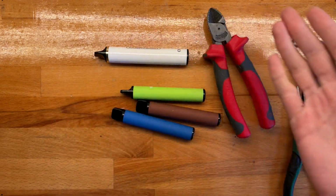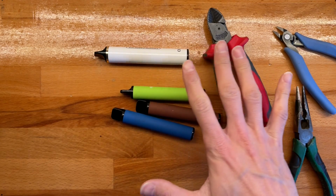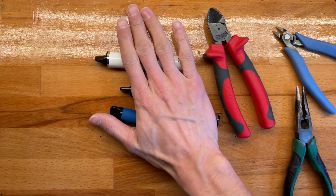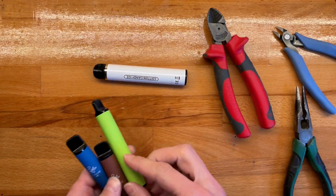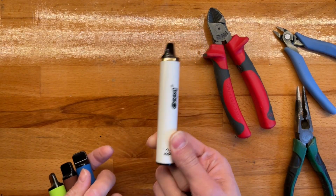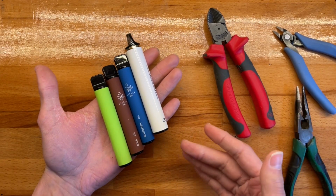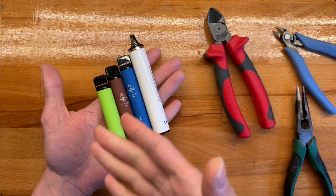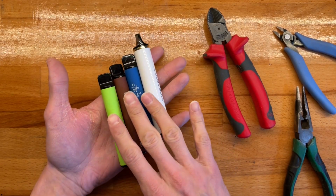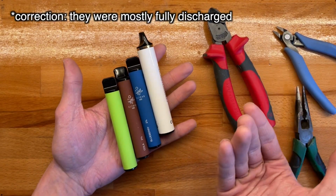But yeah, basically what I've observed, and what he actually went over on his channel, and what I'll basically copy on this channel with a bunch of, I'm not sure he did this one, but basically anyone finding these has to pick them up because they contain 400, in this case, 400 milliamp hour cells. And this big one, I have no idea how beefy this is, but we'll check it out. And just to make this video a tiny bit different from his, I will actually time-lapse a discharge and probably just a charge cycle with my power monitor, just to see exactly the capacity of these cells after, what, like half a use, because they still come up at around 3 volts, 3.2 even.